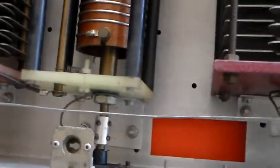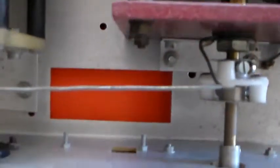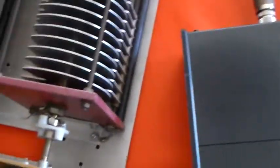Now this is the bigger tuner here. These capacitors and this roller inductor I bought for a different application, but I ended up throwing them in this box and just wiring them up to use for amateur radio. And it will not tune 6m at all — doesn't want to know anything about it. It's probably because it's got this very long wire here. There will be lots of stray capacitance all over the place in this thing.